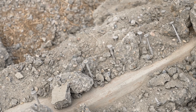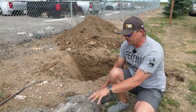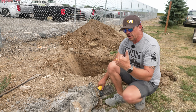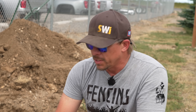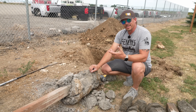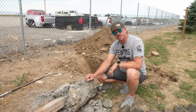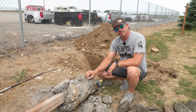We just have to break the concrete into smaller chunks — it's still going to come off. We've seen cases where we had to work this hard to break it off after yanking with a 10,000-pound machine just to get the concrete and everything out of the ground — with wood posts, vinyl posts, and steel posts. So if you use good bonding concrete with a really good mix, you'll get that kind of bond without the separate step of welding anchors to steel posts or screwing anchors to wood posts. It's just unnecessary and I really don't see the added benefit, because again, that's just not the failure we see in the field. I'm Mark with SWI in Wyoming — Wyoming's fence company — and I hope you have a great dang day.